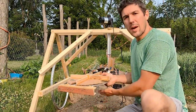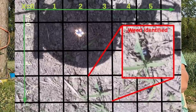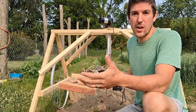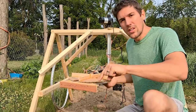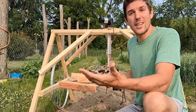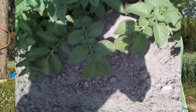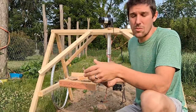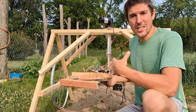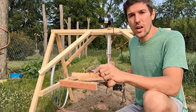Once oriented towards the sun, the camera on the bottom side takes an image of the ground. It then breaks that image into 3x3 inch squares and analyzes each square to decide if there's a weed. I tried using other TensorFlow plant identification models like iNaturalist, but their strength is not identifying weeds taken two feet above in baby phase — they really struggle with that. So instead I took a Raspberry Pi camera around my garden, took photos two feet off the ground, broke those photos into 3x3 inch squares, classified them as weed or plant, and retrained the MobileNet TensorFlow model so that I had a customized image classification model that works for the weeds and plants in my garden. It works surprisingly well. I'll teach you how to do that a bit later in the video.